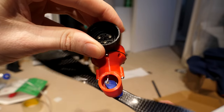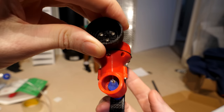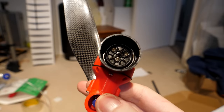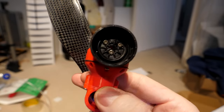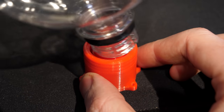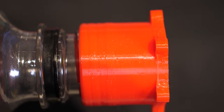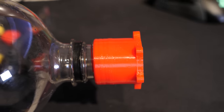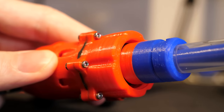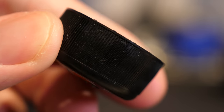The first modification is the removal of the 90 degree bevel gears, which allowed the piston and connecting rod to directly drive the output shaft. The cylinder head is very similar internally to the older versions, but instead of a 3D printed bottle cap, it mounts straight to a standard bottle cap with a few screws and a rubber washer. The reason for this is the 3D printed caps have to be printed flat to achieve a precise thread, but this is also the weakest direction to print as all the pressure in the bottle is held back by the layer strength of the material, which isn't always enough. So I often design the caps with excess material to withstand the pressure, whereas standard bottle caps are injection molded, making them stronger and lighter.